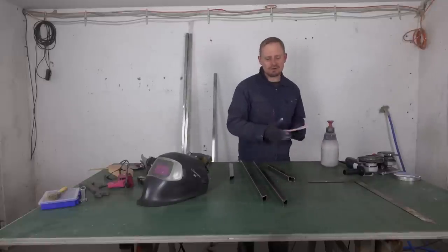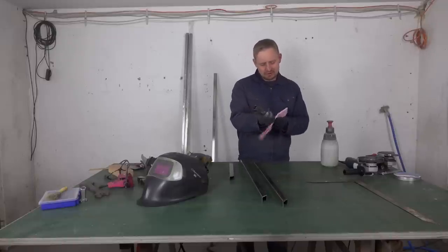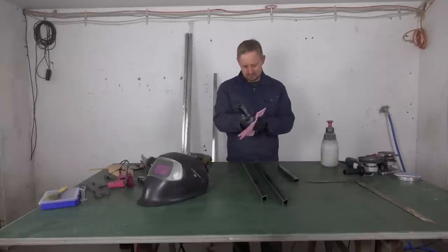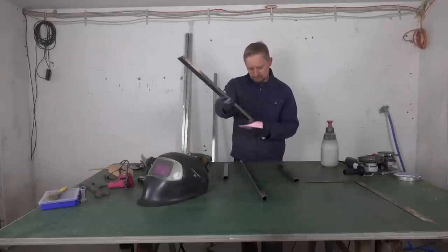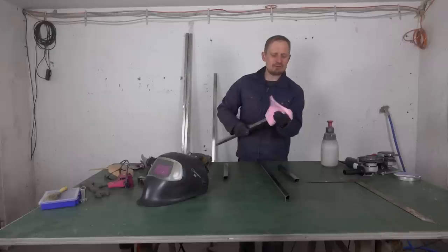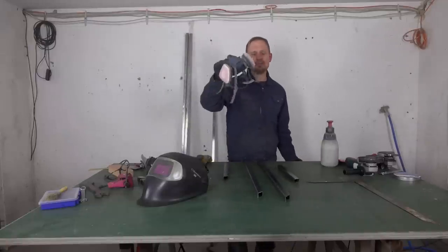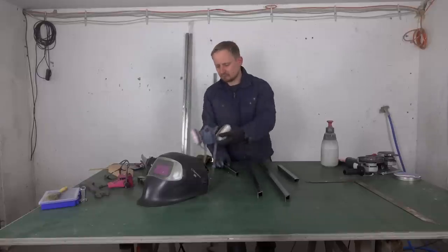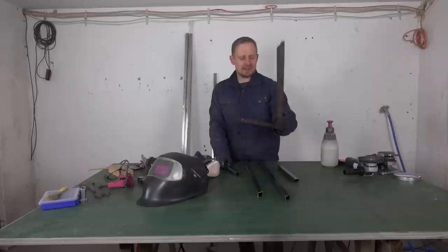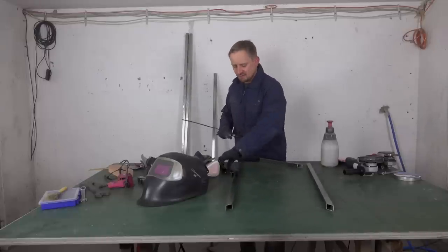I have to wipe off all the tubes with some silicone remover before I can start welding, to remove every fingerprint and grease from the tubes. I use a soft towel and a can of silicone remover, and I wipe off all the areas where I will weld. It's also a good idea to wear a respirator while welding because the fumes are toxic — if you have no ventilation in your shop I recommend wearing a respirator during the welding process. Then using my 90-degree angle, I arrange all four tubes and start to weld the frame.